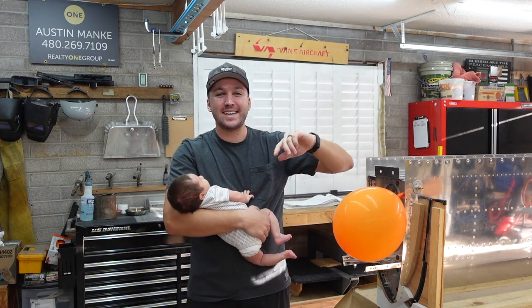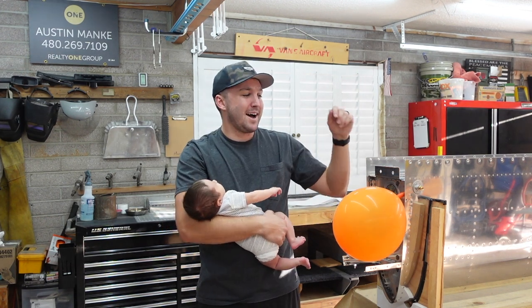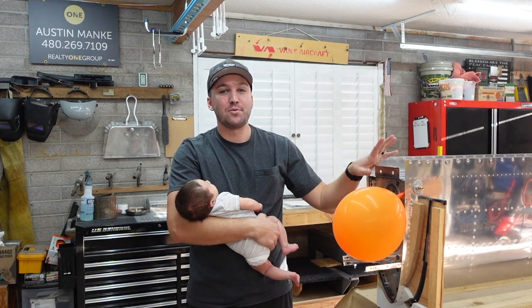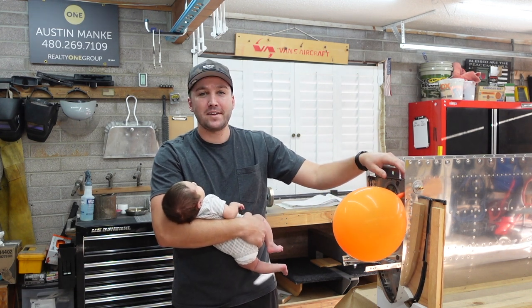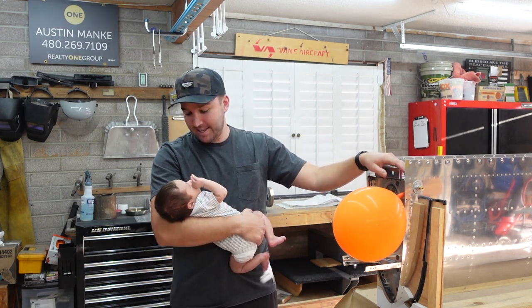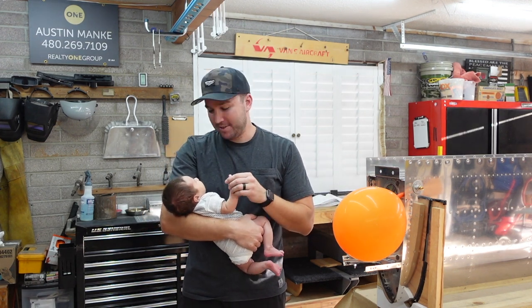I know this second tank, I didn't have as much footage, probably because of this guy here. But no, I really just wanted to jam through it. Working with tank sealant, I knew I was number one fighting summer. It's getting warm here in Phoenix, and tank sealant cures much faster in the heat. So fighting that, and then also fighting wanting to be inside hanging out with this dude.